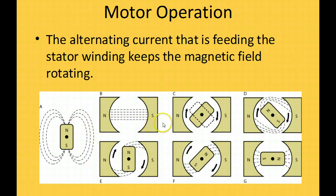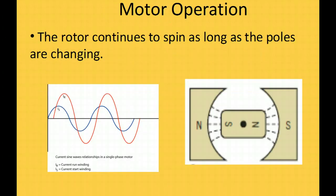If the motor is already spinning, the alternating current is going to continue to make the rotor spin inside the stator — that works great. Except when the rotor stops and is magnetically in line with the stator. If that happens, those magnetic poles are going to shift back and forth, but the rotor is just going to sit there and hum. There's nothing to get it started unless you can reach in and give it a spin, and then it will start.